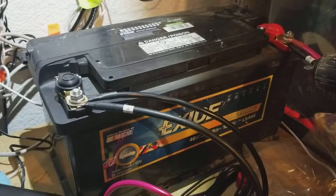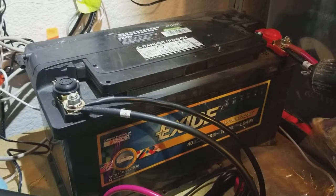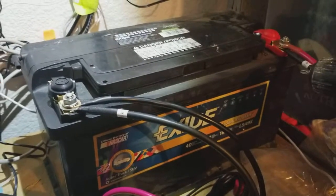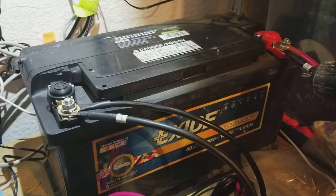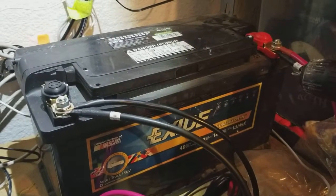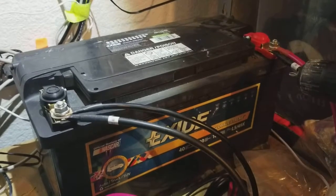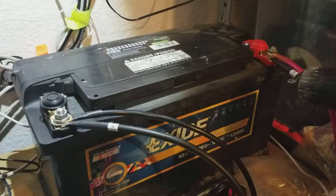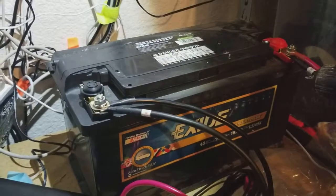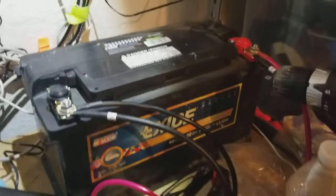The second category is what we'd call either a gel cell or an AGM battery. These are sealed batteries — still have lead plates inside — but designed so you don't have to do ongoing maintenance. They're generally more expensive than basic lead-acid batteries, but great for off-grid systems where you don't want constant maintenance, and they usually offer a better lifespan. Also, unlike flooded lead-acid which must stay upright or the acid will leak, AGM and gel cell batteries can be positioned on their side.